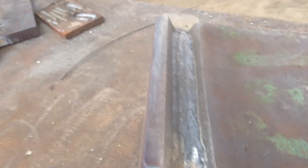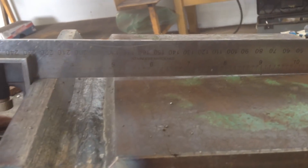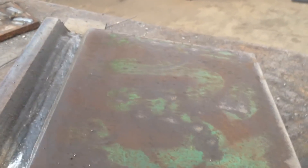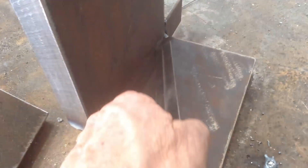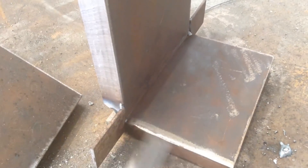So that's our Lincoln welder — quite a powerful bit of gear. We've got three passes in there now. What we do is put our square back on it and see how we're traveling. It's starting to come up pretty square, but it's got a bit of a gap under this end. What that means is we've got to start welding on the other side — we'll flip it over. We need to put maybe one, two or three big fillets along here and this will bring it back the other way. This is how we control the angle and make sure we keep it square.